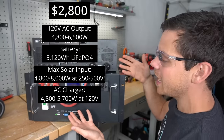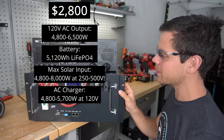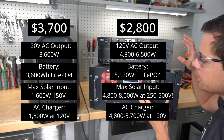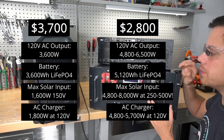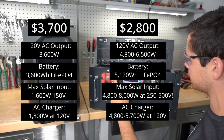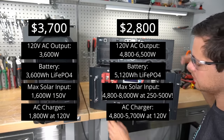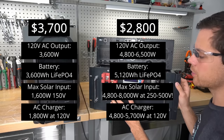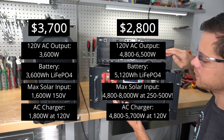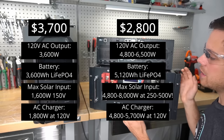Anybody could build this in less than 30 minutes and it's more powerful than everything else on the market. Look at the difference in price and how much more power and capacity you get with the home-built system — this is almost plug and play with just two cables. Make sure positive is connected to positive and negative to negative, and don't turn the battery on until everything is connected. Follow the startup procedure for your server rack battery because it has a pre-charge resistor circuit that will charge up the capacitors in your all-in-one system — typically you just connect the cables and turn on the switch.